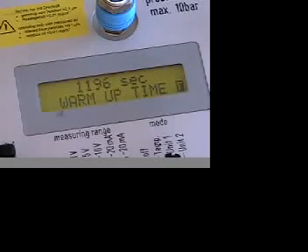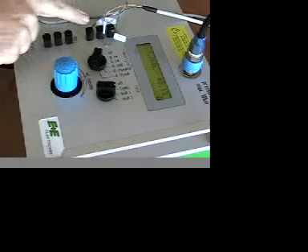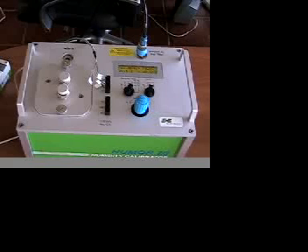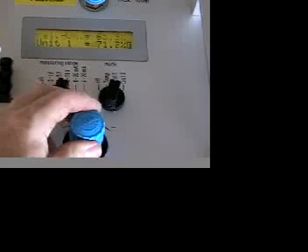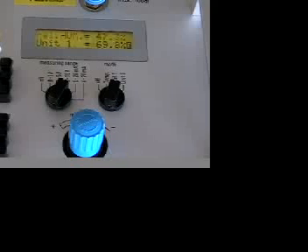Once the system is warmed up, the display will indicate the humidity in the chamber. As you can see, there are terminals on the calibrator where you can obtain a variety of power sources and deal with a variety of different output signals. Now, insert the sensor probe into the chamber. Once the sensor is inserted, you can then adjust the blue dial to your first calibration point. This dial regulates the pressure between the upper and lower chambers. Just watch as I adjust this — you can see how quickly the humidity stabilizes. You then have to wait for the sensor to stabilize, which is based on manufacturer recommendations. For an E plus E electronic sensor from Airtest, the time is typically about 30 minutes.